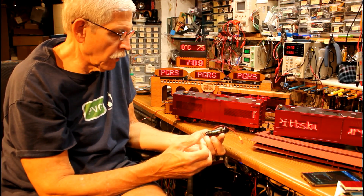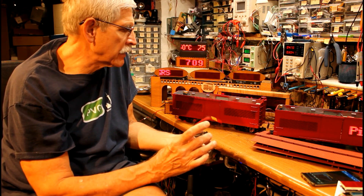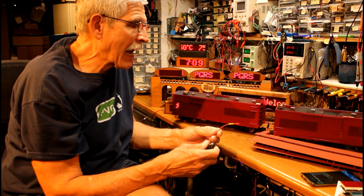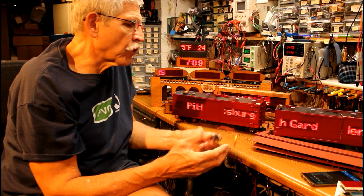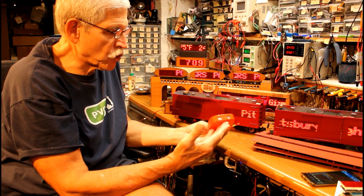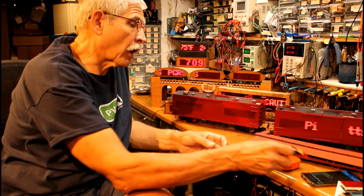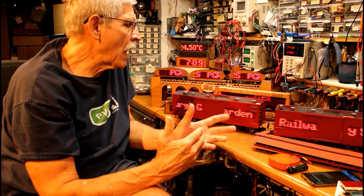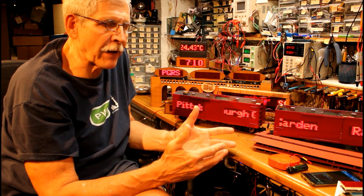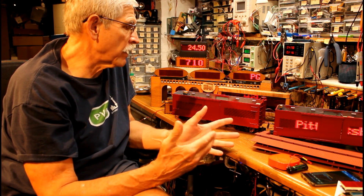Power for the whole thing comes from a single 18650 lithium cell — supposedly 3,000 milliamp hours with a protection circuit to prevent overcharging or over-discharging — and it runs for several hours without difficulty. You could also use a small cell phone battery pack that supplies five volts; it's happy anywhere from about 3.5 to 5 volts. You could power it from the track, but track power comes with intermittent dirty power, requiring capacitors or filters, whereas battery power has none of those issues.